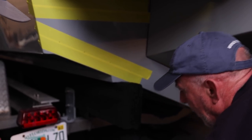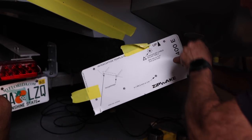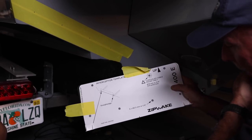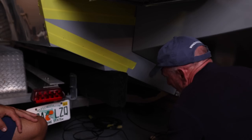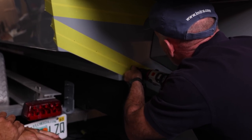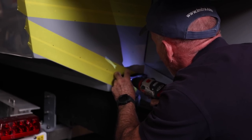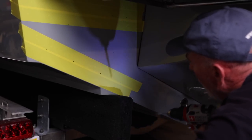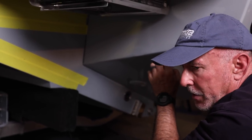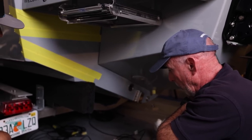The template and manual give you the drill size. We're going to use a 3mm pilot drill — that's one-eighth inch — and then a 6.5mm bit to finish the hole and prepare it for the mounting bolts. I like to use a little drill guide so the drill bit goes in perfectly straight. We go around all the holes first with the pilot bit, then follow up with a quarter-inch or 6.5mm bit to get those holes ready to receive the mounting screws.